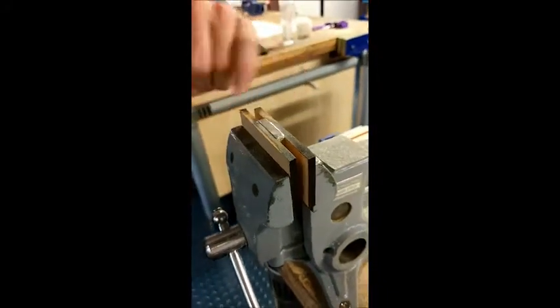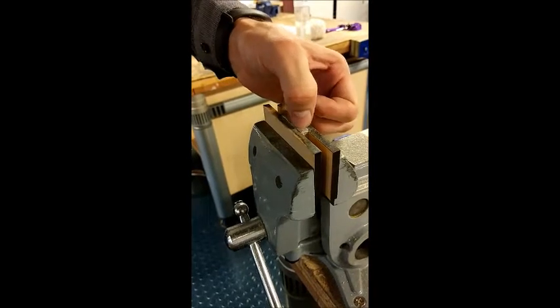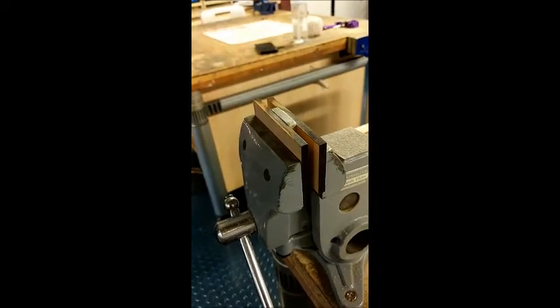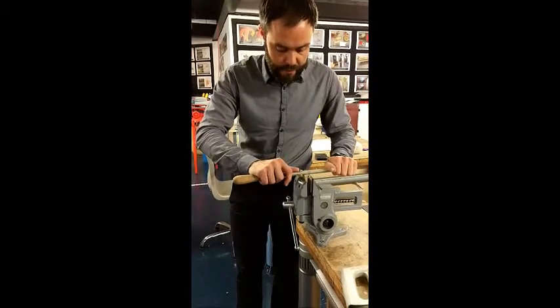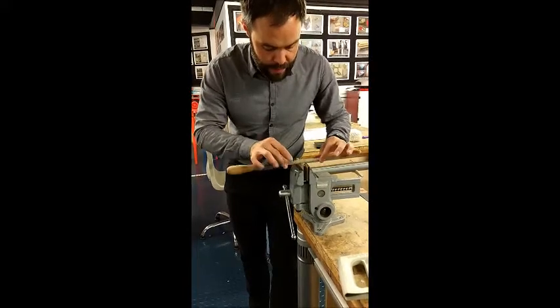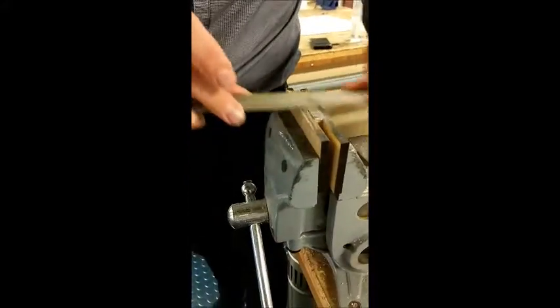This is my cross filed surface. You can see the pattern appearing on the top of the pewter is all going in that direction. Now the next filing stage is called draw filing, which draws out these scratches. I hold the file in a different way and use a different motion — I hold it with two hands at a slight angle, and then very lightly, almost just using the weight of the file, I go across the work in the other direction. This is called draw filing.